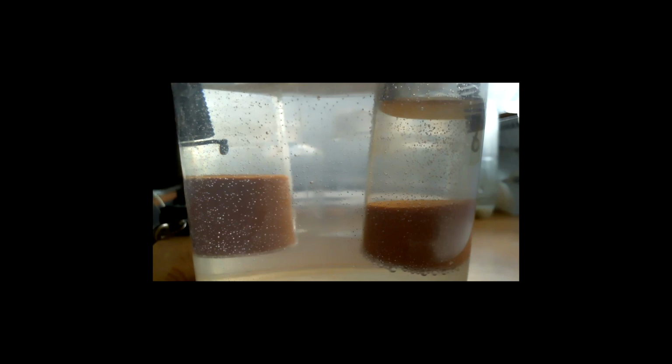If I may just say something, is there not some form of self-healing going on too? That thought occurred to me too. So that eventually the coating would self-heal if you give it enough time. Or if you took it out and extended it, and then maybe a light spray of some caustic or something like that. Definitely. It would need to be not in water but in air, and you need to add some caustic for the self-healing to occur. So when you wash off the caustic, the process of growing more layers stops. Yes, right, and you'd have to put it in a baggie or something and reform those layers to heal it.